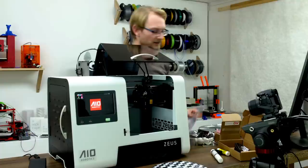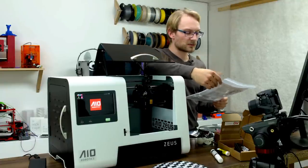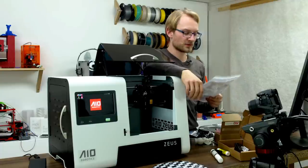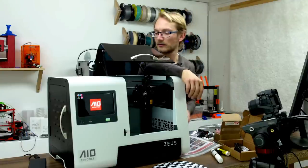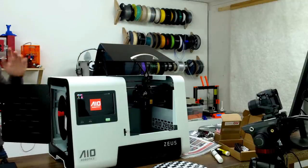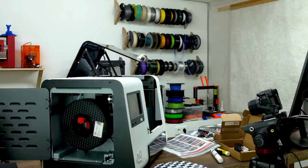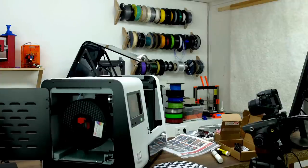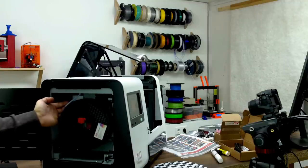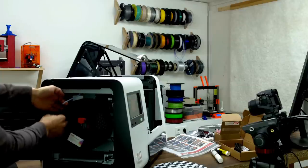Okay, did that. Insert platform into ZEUS, did that. Connect power brick, hold power button, did that. Fill material, so push filament into the reverse Bowden tube. Let's do that right now. So we already partially inserted it, it sounds like. Over here, is that in focus? Yeah, sort of. So essentially there is your little Bowden tubelet, if you can see that. And all we need to do supposedly is push this guy in there.